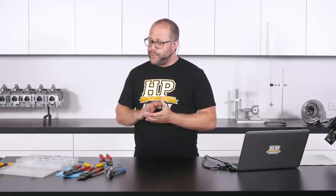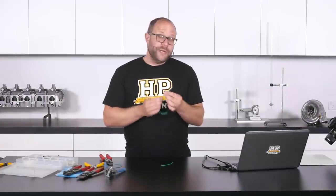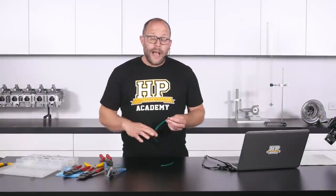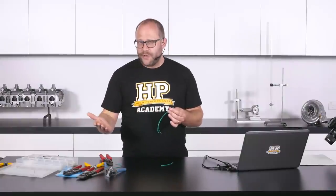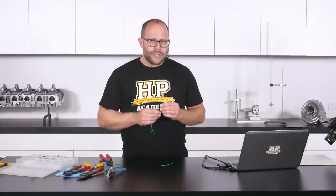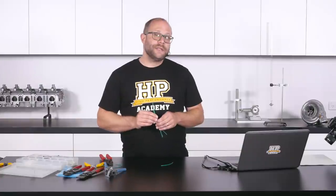For our club level harness where we're using our open barrel brass splice, the demonstration I'm going to show is taking a single wire and splicing it out to four 22 AWG wires — so five 22 AWG TXL wires in total. Each one has a CMA of 700, and with five of them I've got an overall CMA of 3500. That's the calculation you're most likely going to be performing most of the time, as it gets you to the value you need to size the splice you're going to use.